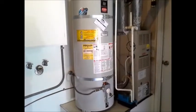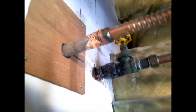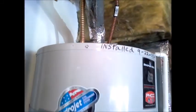So we're back in the garage again. I just want to point out a couple more things with the galvanized pipe. Near the water heater, you have a corroded galvanized pipe, and that's the hot side, and then the cold side coming in, they have tape over the leak, and now it's leaking. You can see rust areas on that.